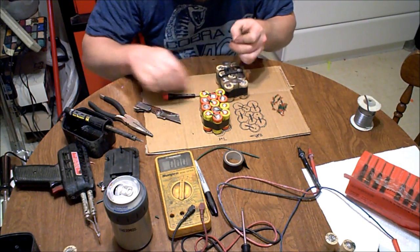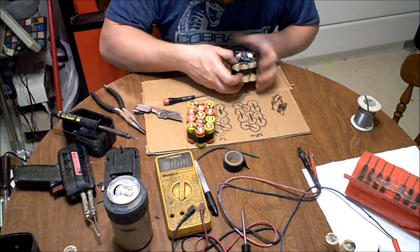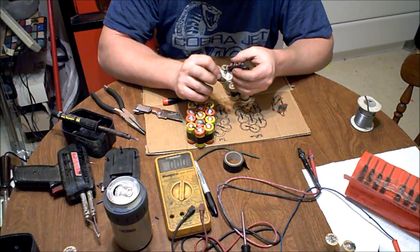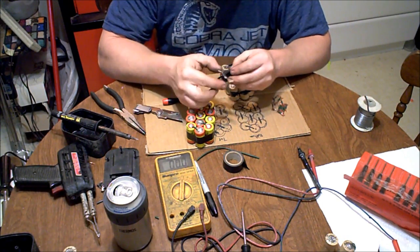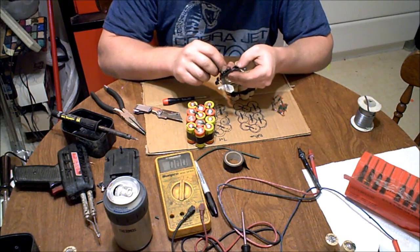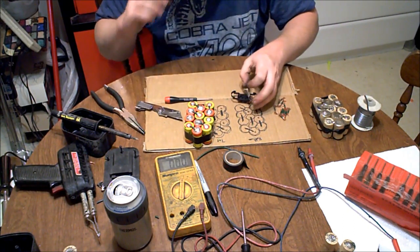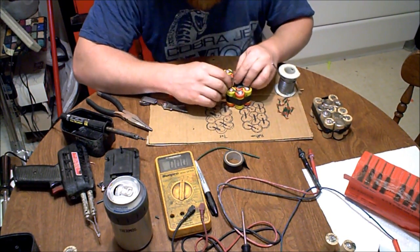This terminal slides over a little plastic piece. Now, I mentioned there was a temperature sensor down in here — I'll pry this apart and it's just loosely attached to the side of the battery. When this gets too hot it stops the flow of electricity. These two terminals touch the negative terminal and that stops the flow to the middle terminal, which tells the charger to stop charging.